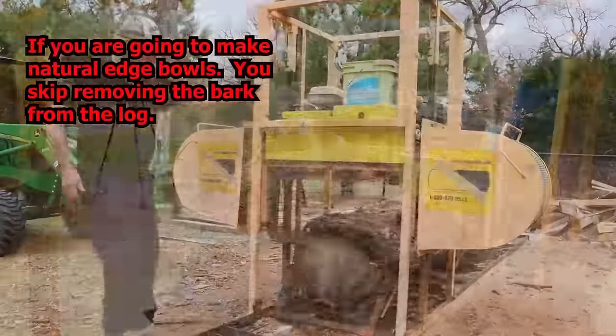If there is, I'm gonna take some anchor seal and coat just those areas that are showing that still want to crack. In other words, I'm not gonna coat the whole blank, I'm just going to coat the area that's showing a problem. Some wood will absorb this stuff faster than others. Some wood also has more stresses in it than others. So this is just the nature of wood.